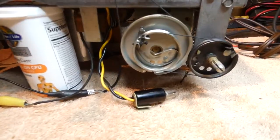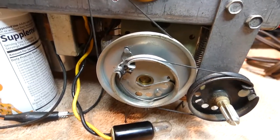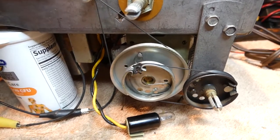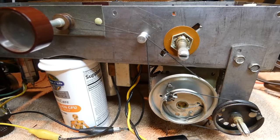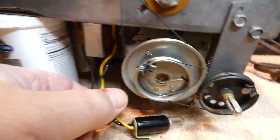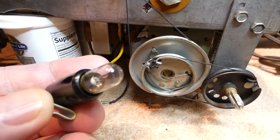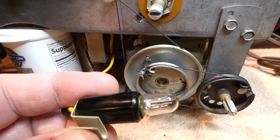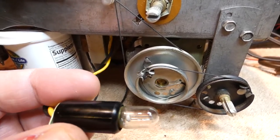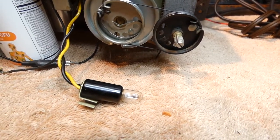Amongst other things, both the tuning strings were broken, and I spent a considerable amount of time on that. I found a schematic that actually had the proper stringing diagram, so I took care of that — now this works out as usual with Zenith AM/FMs. This is no different from any other Zenith AM/FM: we have a bread slicer on the AM side and slug tuning on the FM side. Also, the dial light didn't work. For those of you familiar with Zenith, these use kind of pseudo-special bulbs — an NE51 — they're almost impossible to find, but I found a box of them brand new a couple years ago. That's a NOS NE51 bulb.